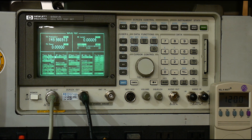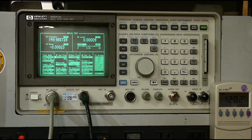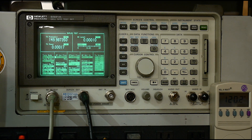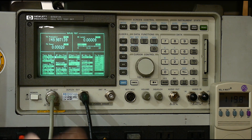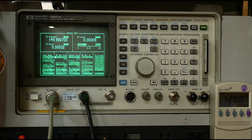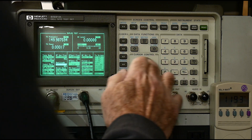Don't do this with the spectrum analyzer because we're going to bring in 60 watts, but this machine can handle 60 watts — it has a high wattage attenuator built into it. It's a radio test set. So let's go ahead and set the generator to 500 megahertz. What we're going to be looking for is when we enable the amplifier, the system will automatically measure the frequency — we should see 500 appear here — and then we should see the watts appear here. Let's turn it on and send in some amplitude: minus 20 dBm.